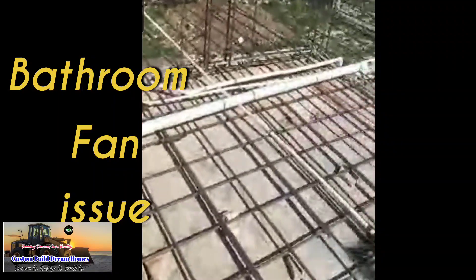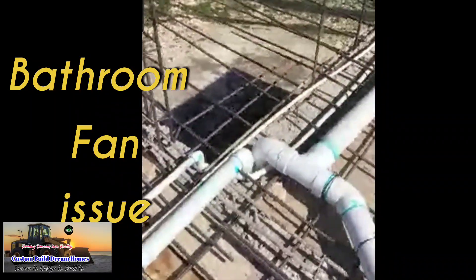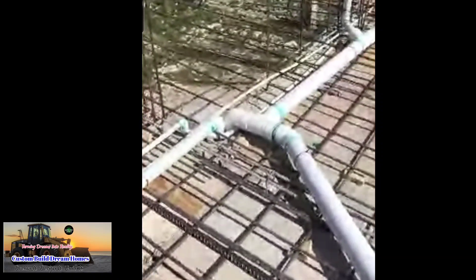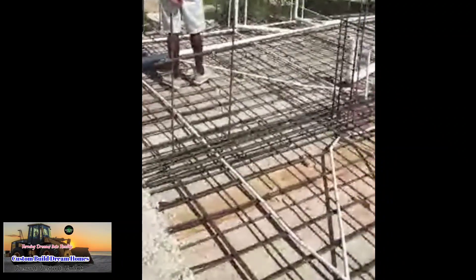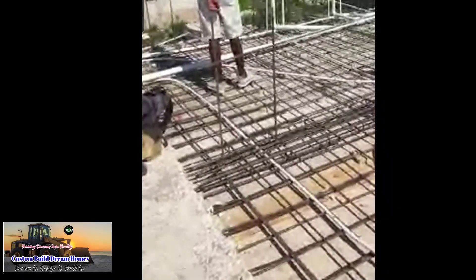We're going to have to use the drywall instead. Based on the plumbing pipes already being done up to drain into this particular column, the piping for the plumbing has to run the way it runs. With that being said, the exhaust fan for the bathroom cannot be vented out to the side because that's where the fan would be placed and where it would need to be vented. That black mark is where the fan would drop based on the bathroom location below, and to vent that fan it needs to be vented out to the side of the building — but all the plumbing work is already set on the outer part of the wall. So for this bathroom, we're going to have to use a sheet rock in order to place the bathroom fan.